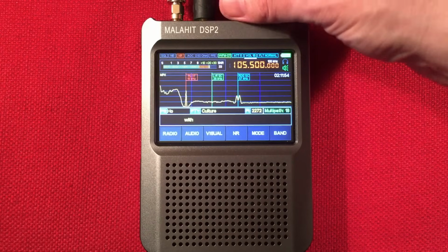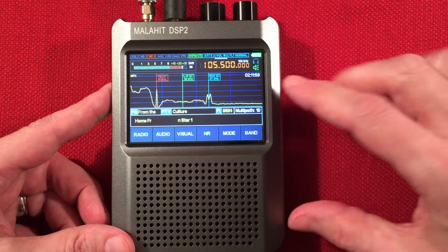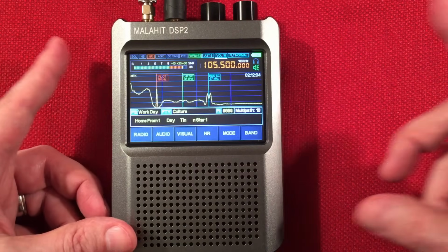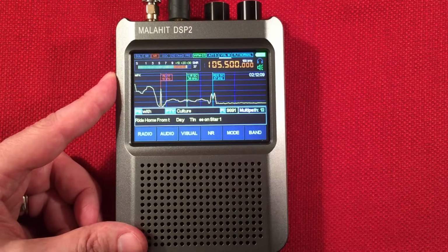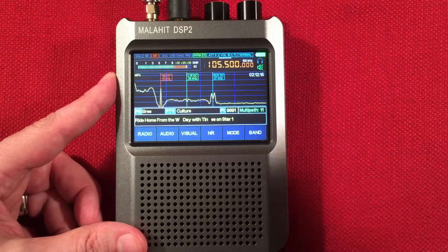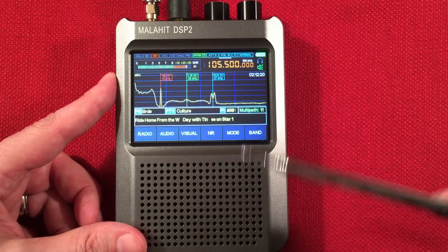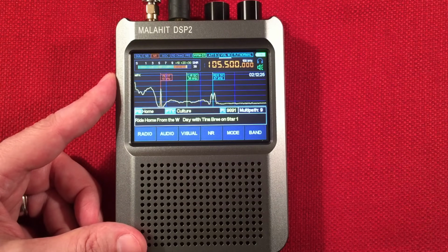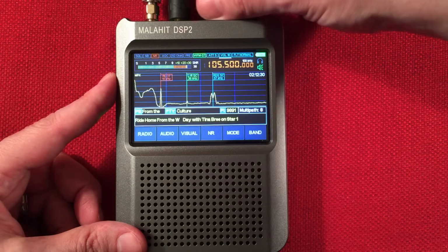So it scored, I do a 5-tier method. Fair, okay, good, very good, excellent. Excellent is 100 stations found, fair is like 10. This scored good to very good. So found 71 stations with the included whip antenna, using this only for all my tests. And yeah, it worked out great. FM, so 71 stations found, gets a good to very good rating on sensitivity. Selectivity also gets a good to very good because I was finding faint stations next to strong stations, which was fantastic. But right now we're in the RDS menu mode here.